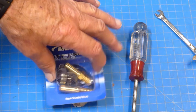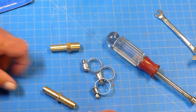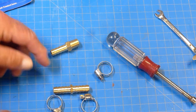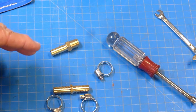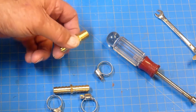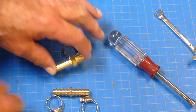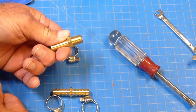Inside — I've already pre-opened this — there are three hose clamps. Two go with this splice piece, which is used to repair a hole or damage in the running length of the air hose. If your hose end is damaged, that's what this other piece is for, and it only requires one clamp.